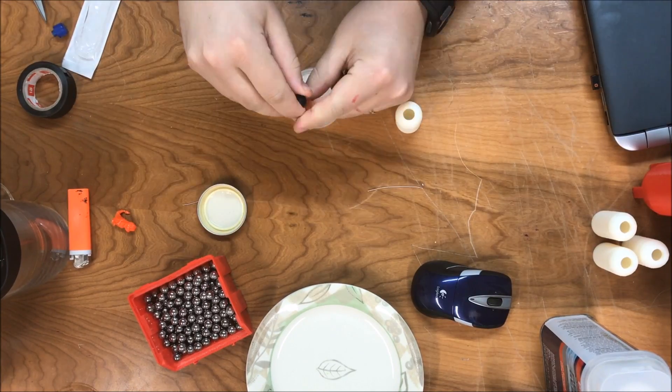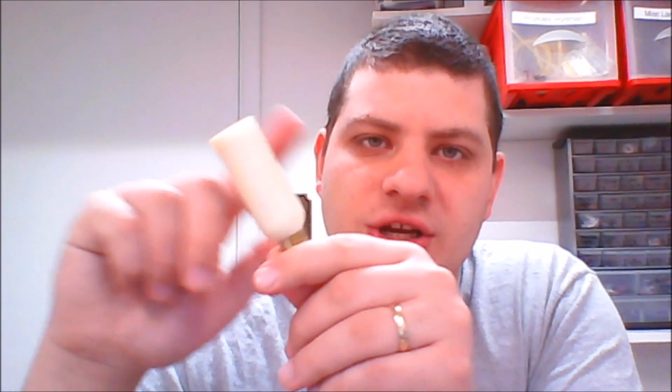I did that three or four times. When you saturate acetone with ABS, you get a solution that — when the acetone evaporates, which it does readily at room temperature — leaves behind the ABS. So in addition to smoothing the inside, it also left an additional film of ABS. This was a viewer recommendation. Another one here has been sealed with a fiberglass resin used in boat or automotive repair — nothing hard to find, just available from a big box store. I mixed some up, sloshed it inside just like the slurry, and then used a paint brush to lightly brush a coat on the outside.